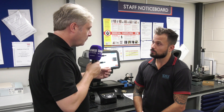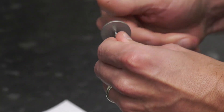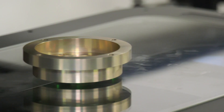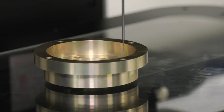A brief example — the pins is one of the things we'll have a look at in a moment. How long would it take to measure a batch of 10 before and now? Before, you'd have to check every component with a Go and every component with a No-Go, so it'd probably take about 30 seconds for 10 components, whereas this will take about five. So a massive time reduction — and more accurate. About two microns.